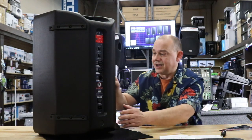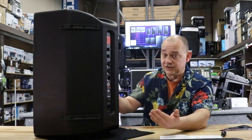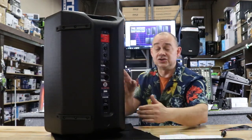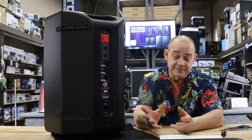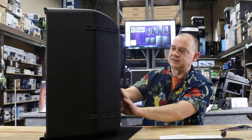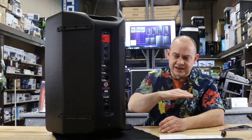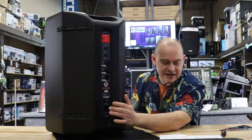We did it — it sounds pretty good. Scary. Remember, if you're going to use this with Bluetooth, make sure you turn the volume down on your phone before you start to play, because it'll jump on you. After that, you get DSP settings — digital sound processing — so you can contour the speaker the way you want. You can have it in flat mode, a contour mode where the bass and highs are jacked up a little bit, a speech mode, and then there's a crossover built into it. So you can put it in with a subwoofer — it cuts off at about 80 Hz.